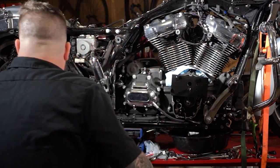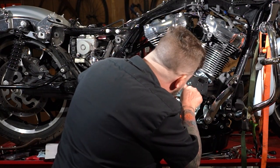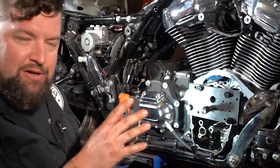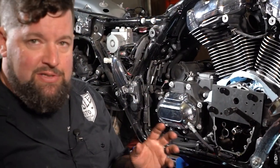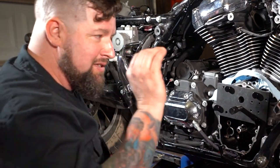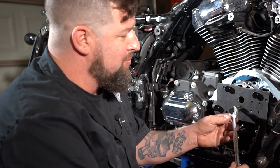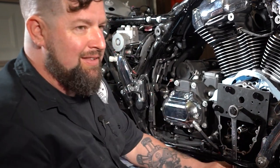From there, here's what we're going to do — I'm going to take my light, stick my head in here, and make sure all this lines up when it gets back there. The other mounting hole will work like a little peephole. Now that I can see it's all started in and I have that step bushing on there, I'm going to crank this in. Not going to use a lot of force. If it starts binding or starts doing anything weird, stop. I'm going to slide it on in there, and when that shoulder gets to the face of the case, that means the bearing is pressed all the way in — you don't want to go past that. There should be a slight increase in pressure on the wrench at that point, and you want to stop there. Remember, I have a decent amount of leverage here, so light touch.